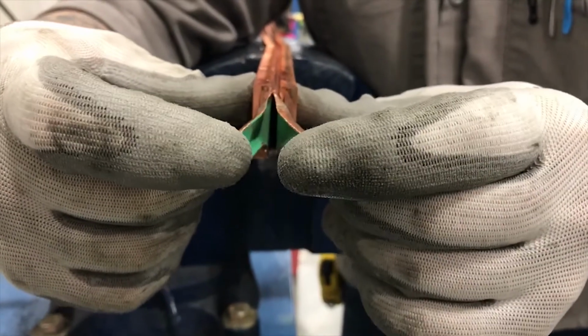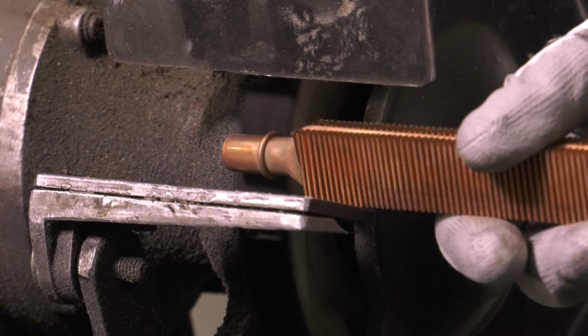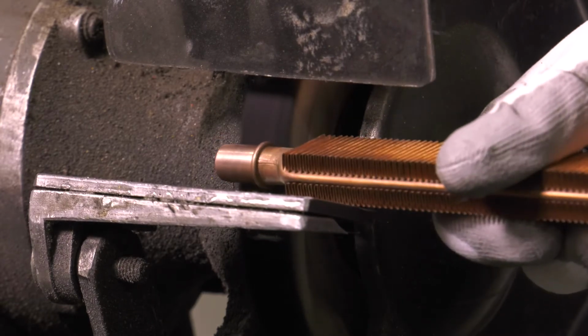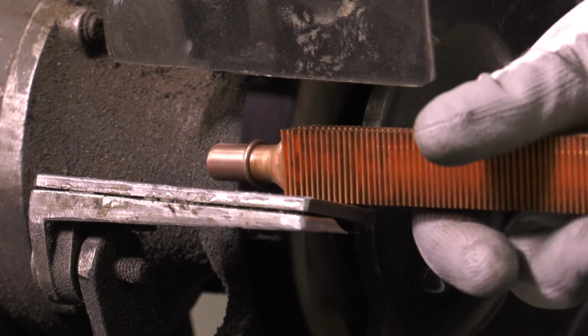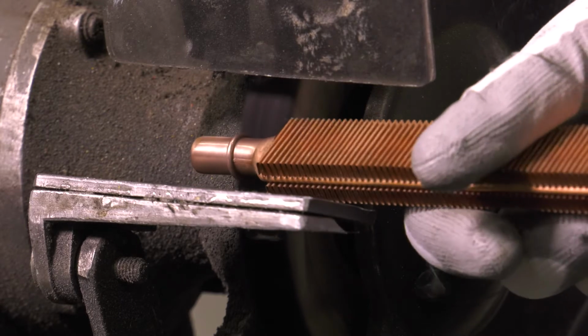Once you have confirmed tube passages are clean, clean tube ends to make it easier to reinsert them into seals. Use a polishing wheel and copper polishing compound. If this doesn't do the job, use a wire wheel as recommended in the service manual. Be careful not to mar the ends.